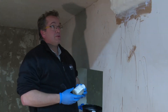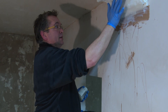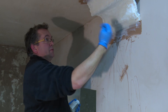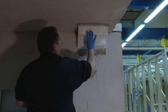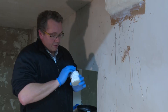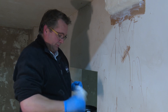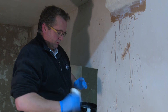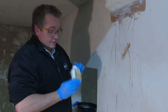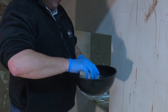The final segment of this process is to produce a supportive case, which will keep the shape of this rather soft and thin layer of silicone. We've been careful to eliminate any undercut, because this support case will be rigid and will need to come off in this direction. The resin does sediment, so it's important to shake it before you use it. The part B, however, does not sediment, so there's no need to shake that part. Begin by adding the full part A, having shaken it thoroughly.